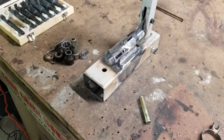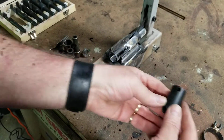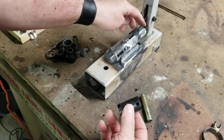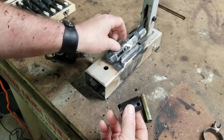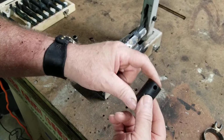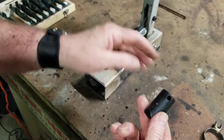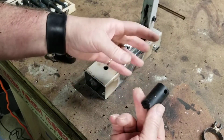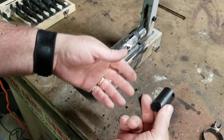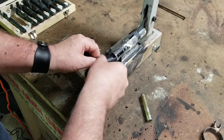Now, before I cut the hole in it, this is one of the original jaws. Whoa, right there, see? We're having problems because the first ring bender was a square shaft and it was easy to join the square HDPE, Delrin, whatever you're using, to the metal square shaft, and it wouldn't turn because it was in a square piece of pipe. Well, this is round. So we had to find some way of stopping it twisting.